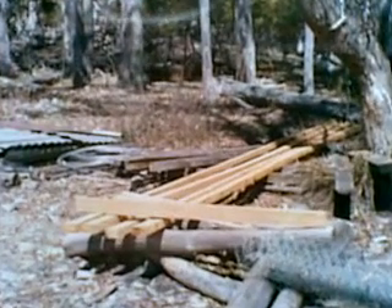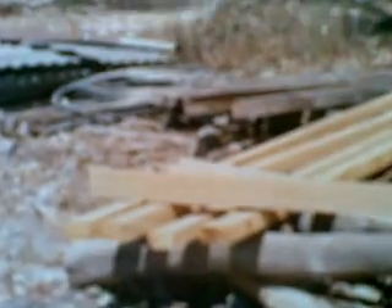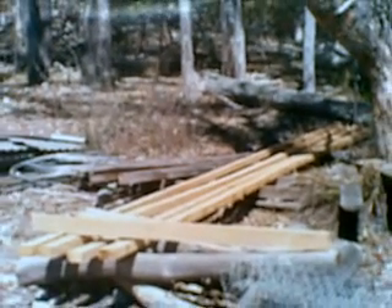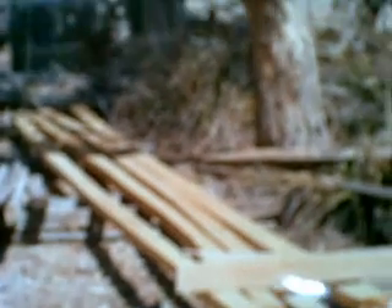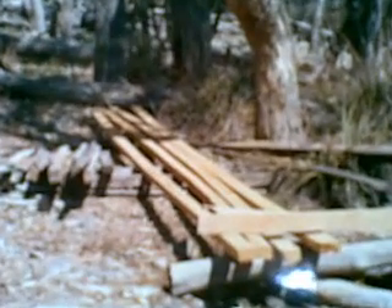When I began my first big project I didn't realise that, and I spent an enormous amount of time painfully and slowly drawing a chainsaw backwards through a 24-foot long tree to make four 4x2 purlins. By the time I'd cut them they twisted and warped and changed shape, because I didn't realise that wood shrinks along the growth rings. So you have to quarter-cut mill timber or it's going to be pretty useless.